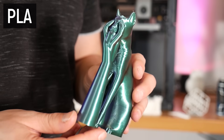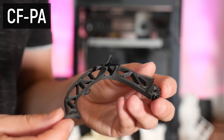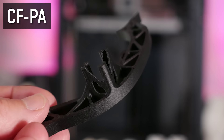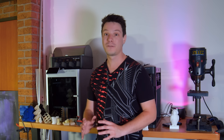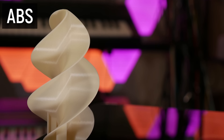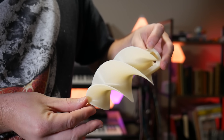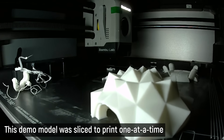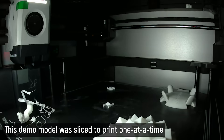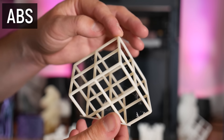All the prints I've thrown at the X1 Carbon have turned out perfect, but I'm most impressed by these two in particular. This CF nylon part is absolutely incredible — it's dead flat with no warping, yet has barely any first layer inaccuracies like elephant's foot effect. And this ABS spiral — printed in ABS from 2017 at a 0.12 millimeter layer height with no support material — tell me another 3D printer that can do this with this sort of quality at this speed. I did have one print fail after the first layer, but the camera detected it and paused the print — a very handy feature. I also pushed the printer to its limits with a carbon fiber lattice torture cube, which it did complete.